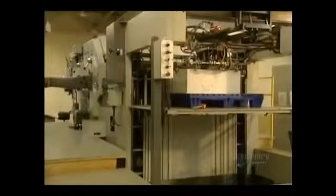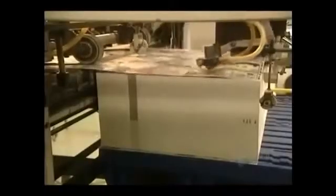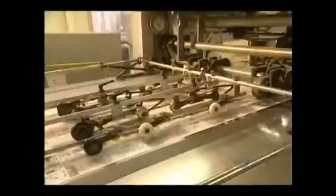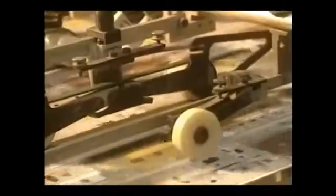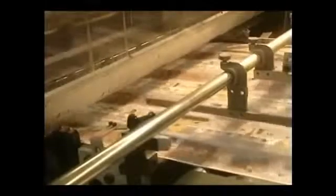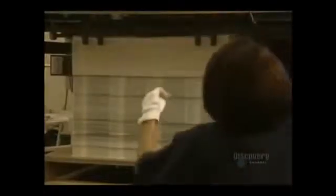This press cuts the pattern seen on the puzzle. Here's how it works. The sheets, or printed cardboards, go into the drawer one by one, where they are cut according to the master model. We clearly see the press making the cut in the puzzle sheet. The cut sheets pile up on one another.